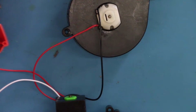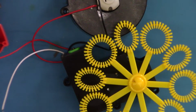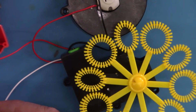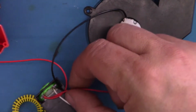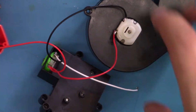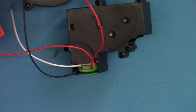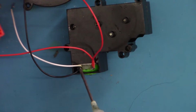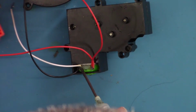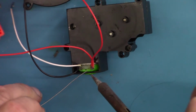And just to test this now, I'll pop the windmill on and cross the wires. There we go. Okay. The last thing I want to do then is just check the solder on these. I think at the moment they look okay, but I'm just going to add fresh leaded solder and make sure that it's a good job on there, rather than where they've made it at the factory. Obviously they've got to make as many as they can, as quickly as they can. So we'll just add a bit of attention here.